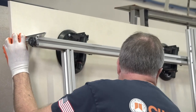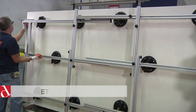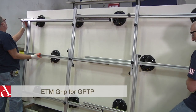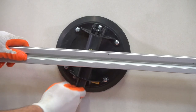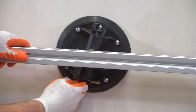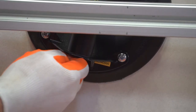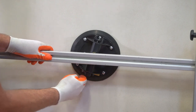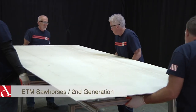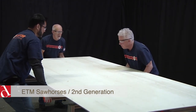You can see a speed square is being used to set the foot of the rack, so that when the panel is turned vertically and stood up next to the wall it doesn't hit the ground. Here we see the suction cups being fastened properly — checking the pump cups to make sure the lines are not visible. You'll want to do this every time you move a panel. Here we can see lifting of the panel on the rack.